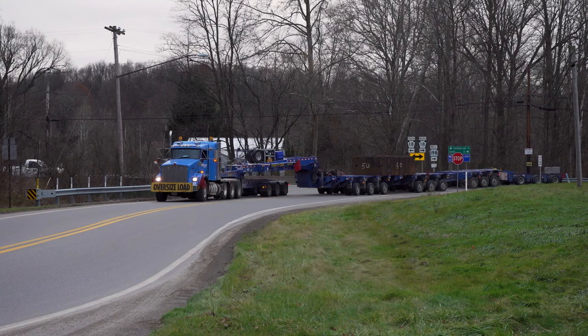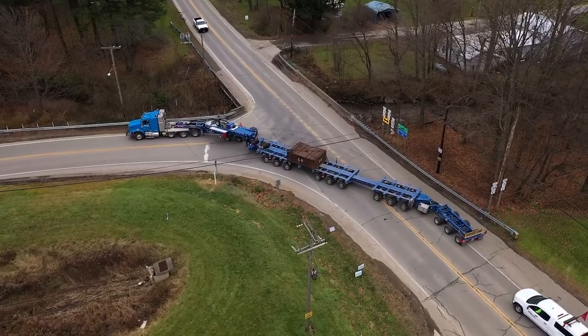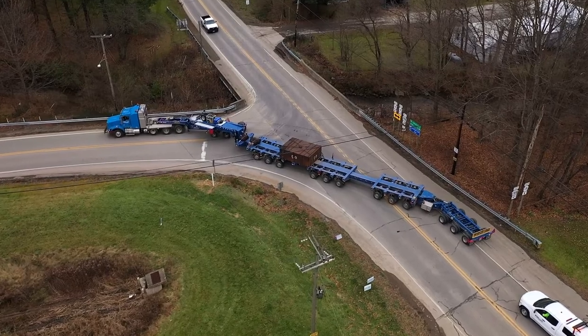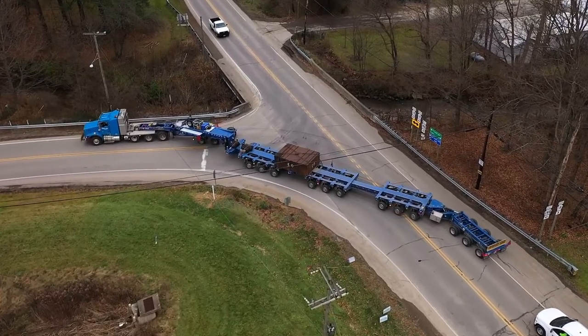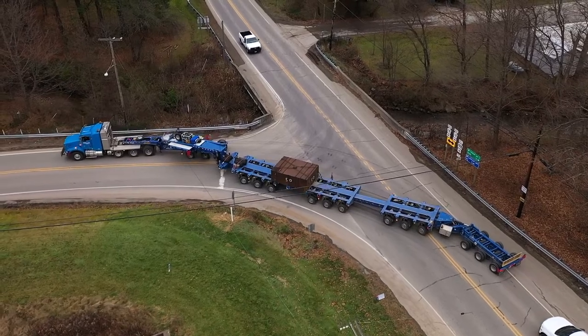With the traditional 19 axle, there's a lot of time wasted making turns — starting up motors, getting everybody in position. I don't have 20 minutes making a turn. I can do a turn in mere seconds. This thing will just walk around the corner on its own, guided by the fifth wheel on the truck itself. There's no motor startup involved. It all runs hydraulically.